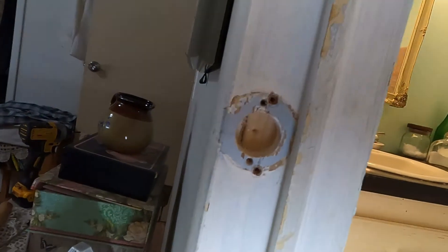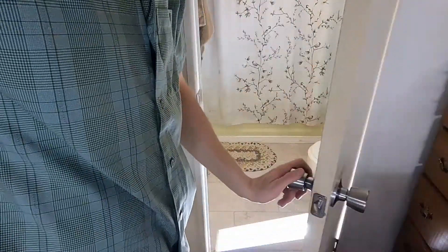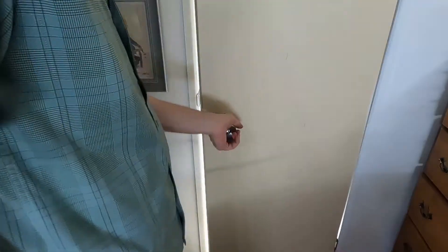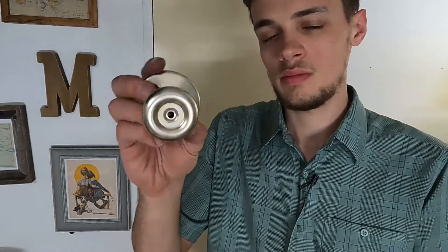Let's go ahead and put that back on and then we'll try it out and make sure the door works. Works like a charm — latch is good, it's good to go. All right guys, that's how you change out a handle on an interior door. I really like the look of the brushed nickel on the new handles — it's a real modern look compared to the brass, almost brushed-brass-with-age look of the old ones. Plus these ones are all metal, so they're not going to break. Thank you guys for watching. If you found it helpful, make sure you like the video, drop down in the comments if you have any questions, and don't forget to subscribe to the channel if you want to see more of my content. Until next time, this is Nathan signing off.